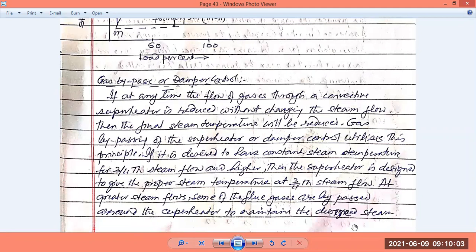How we create temperature in the furnace: we use water as our raw material input in the power plant, and convert it into steam by boiling it by means of heat. That steam then gets superheated to around 580 degrees centigrade. This superheated steam, which has no water droplets, passes through the nozzle under specific pressure, converting heat and pressure energy into kinetic energy — the velocity of the steam flow increases. The heat for boiling comes from burning coal inside the furnace, creating high temperature.